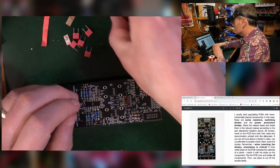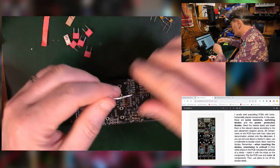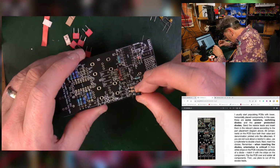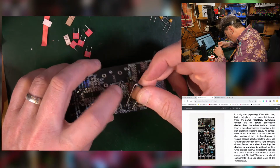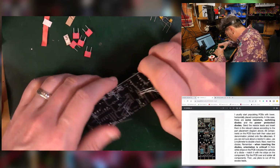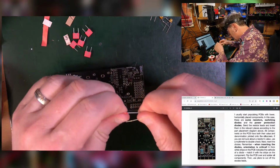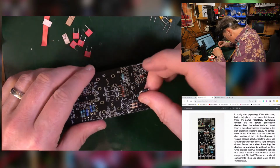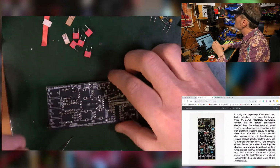That's cool. Then we've got these 2 fat ones here. Oh, these are power regulator ones. Big and chunky. One goes over here. This time the black line, as was on the other one, is now grey, but it's still the same deal. That line goes with the line on the print on the board. So it's the right way around. Oops. Thick old legs. This one goes that way around. Make sure that's right. Good. Then you've got a whole bunch of soldering.